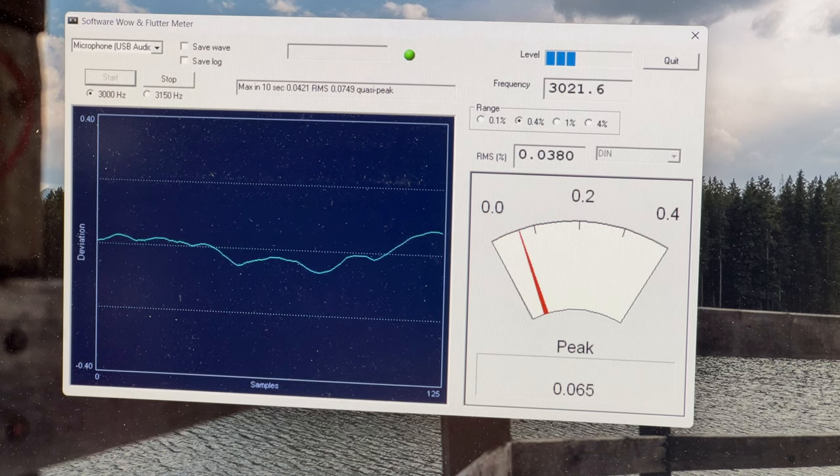Well, I gotta clean the other side of the contacts too. That's no problem though. Oh, that is looking good now. One more pass with the isopropyl alcohol. Okay, that side of it is about ready to go back together then. I'll put some DeoxIT D100 in there as well to lube and stuff, but we gotta service these little contacts.